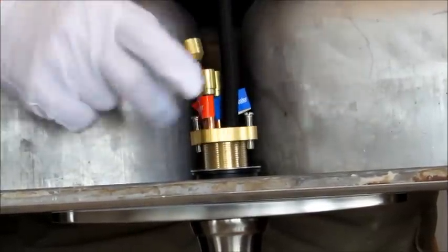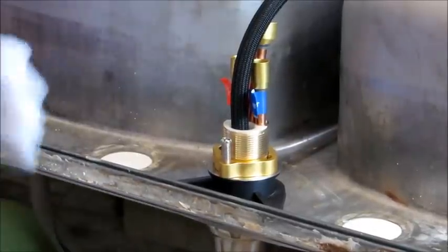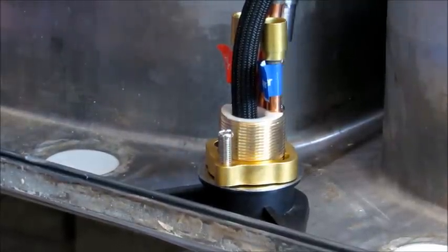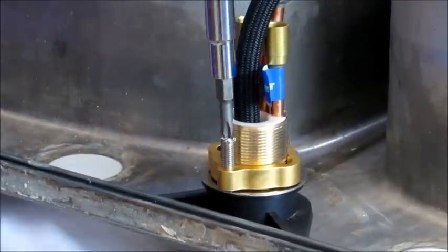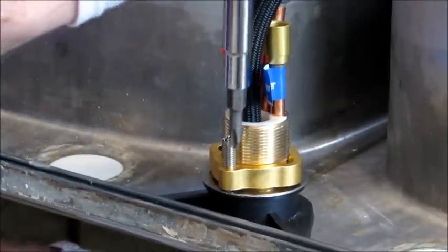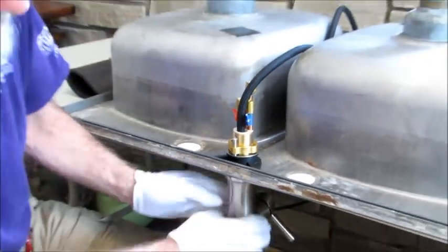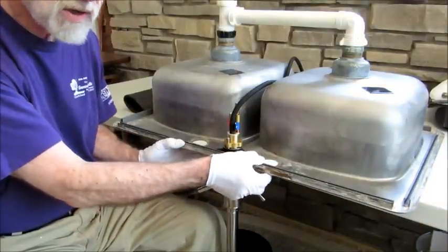That's about what it's going to look like — a nice solid surface that won't jiggle around. I've managed to get this jam nut down onto the threaded tube as far as possible. We're just going to bring these up a little bit on one side, a little bit on the other side, bringing it up square and putting the force on evenly, front and back. We're going to check to make sure the valve is exactly the right position — I've got it pointed straight out — and that the escutcheon plate is lined up.